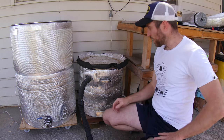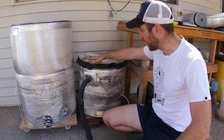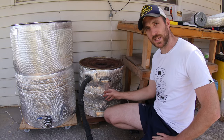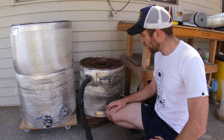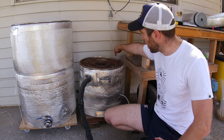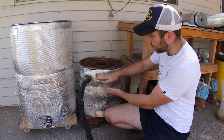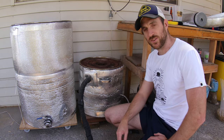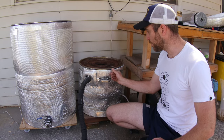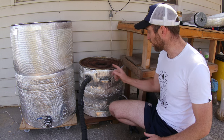Under those plates is k-flex insulation, which has gotten quite squished. Once I take this off you'll see this is simply just a large stock pot — that's it, I made a boiler out of a large stock pot. To seal the top I created a silicone bead around the edge, and when you sit the lid on top with the insulation and the two weights, it's enough weight to keep down the little bit of pressure that builds up inside. This also acts as a safety valve — if the outlet blocks or the valve is shut, the lid just pops up and starts venting steam out the side.